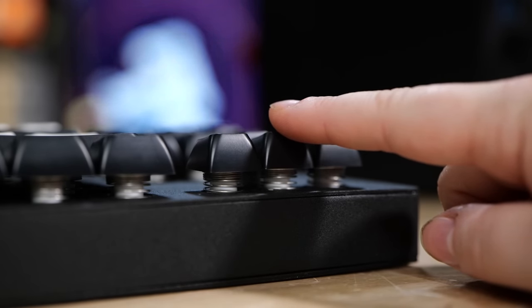There you go. And this is very, very strong because the connector is grabbed on the sides mechanically by the case. So you can't really see it, but there's a 3D printed adapter that's part of the design that grabs onto the sides of your USB Type-B connection. All the USB Type-B connections have little places for you to grab it if it's surface mount or panel mount. Everybody wants the plastic to meet plastic, but really the designers, when we're talking about keyboards, intended for it to be used like that, where this thing basically goes inside the device, and that puts all the mechanical strain on the sides of the connector, not the electrical part of the connector.